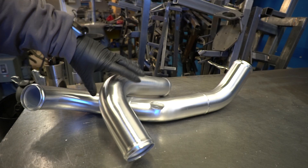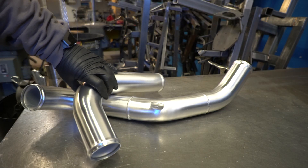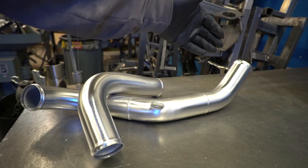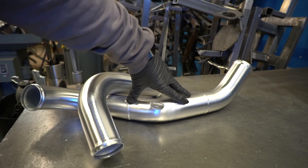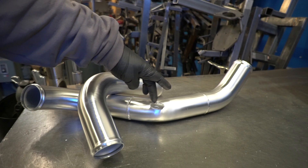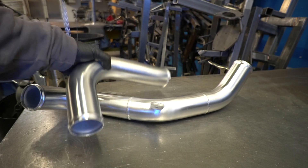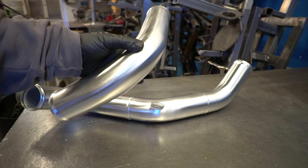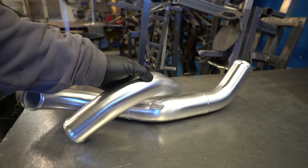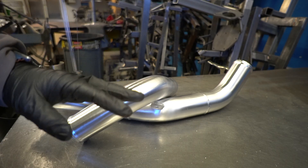This is our two and a half inch intercooler pipe, all manufactured out of 6061 aluminum. We get the bends in, we have fixtures, we cut each one of these, put it in our jig, tack it, pull it out, weld it, put it back in, weld the bracket onto it, then we bead roll everything, and finally we put a Scotch-Brite finish on it. We've got one Scotch-Brite wheel for stainless and one for aluminum — we don't contaminate anything back and forth.